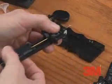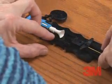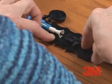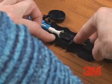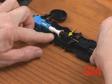Pull the fiber back until the end of the fiber is flush with the funnel end. Place the fiber holder in the actuation tool. Slide the fiber holder forward until it stops. You should see a bow in the fiber beginning at the gauge marking on the actuation tool.